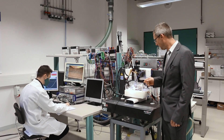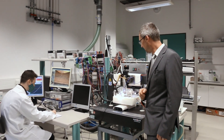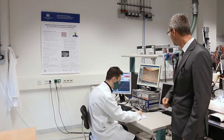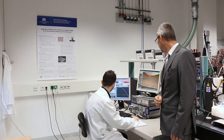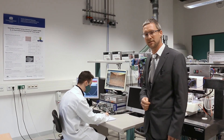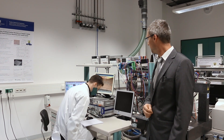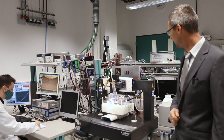For today's experiment, we chose an additive manufactured steel 316L. We are machining it with a nozzle diameter of 200 microns. You can see the microscope image of the nozzle and the workpiece surface. We are machining with a nozzle velocity of two millimeters per second, a voltage of 60 volts, a working distance of 200 microns, an electrolyte supply of 15 milliliters per minute. The electrolyte itself is composed of sodium nitrate with a concentration of 30 percent.